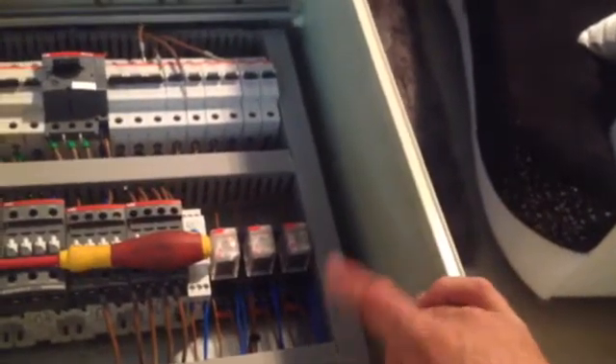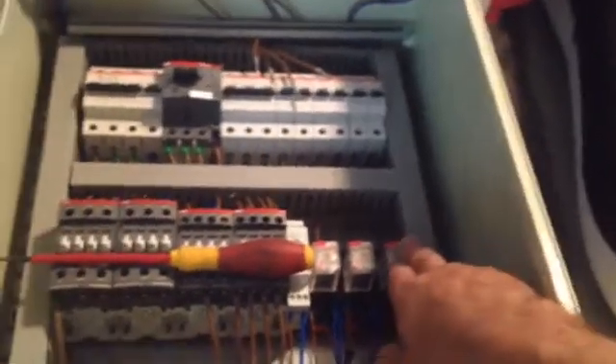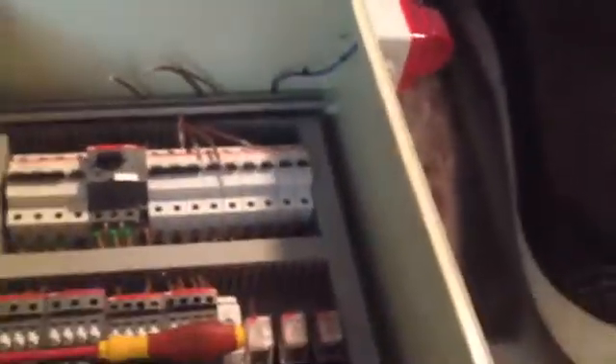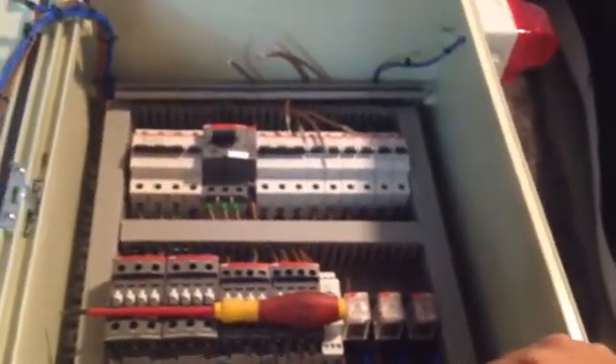When they open the door, there's a little micro switch on the door. When it opens, it'll shut the evaporator fans off and the cooling solenoid off, so it'll pump down and shut the unit off. The fans will go off right away and the light will go on. I put this light in because at that particular place the employees will sometimes just throw the door and it won't shut completely — it'll be almost shut but not fully — and nobody will go back and make sure. I was going to put a noisy buzzer, but the workers begged me not to, so I just put the light.